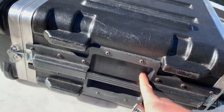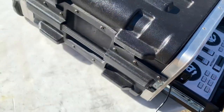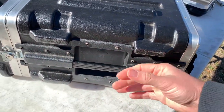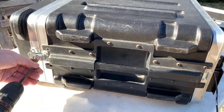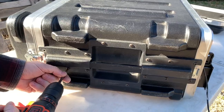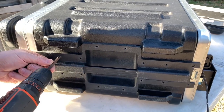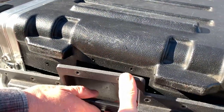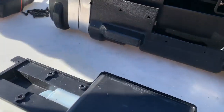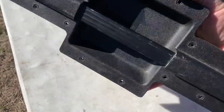Our goal today is we're going to be putting in a male and a female XLR on the side so we'll have a nice clean setup instead of having to worry about cables popping out from up here. We're going to go ahead and see if we can remove all of these plates right here, just pop this bad boy out and make it a lot easier for the install. We got all the screws off — moment of truth. We're just going to drill straight through this — it's actually plastic all the way through, so I think it'll be a pretty easy project.